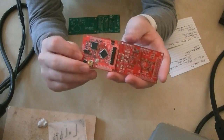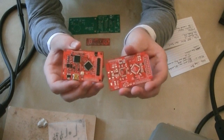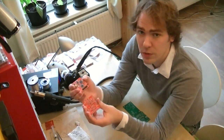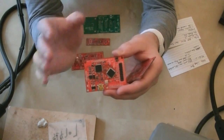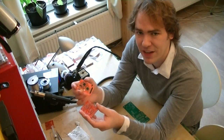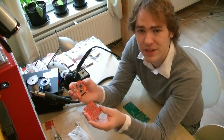The difference between version 3 and version 2.5 is that we moved the USB connector to the end, making it more symmetrical — the header is here and the USB jack is at the other end. That'll help us fit it into a standard case later. We also made one small change to the circuit: on version 2.5, the FT2232 is connected to the CPLD, but there's a better pin arrangement we could have used. There's a clock pin that comes out of the FT2232 chip, and if we put that into the global clock pin of the CPLD, then we can do some fancy stuff like maybe make a logic analyzer. There have been a couple of requests for that, so we wanted to roll it into the version 3 update.